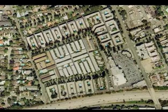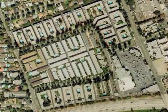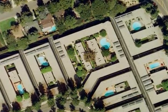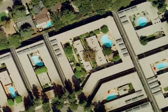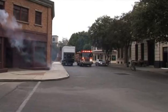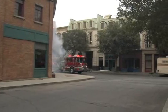One of the challenges that an engine company will face from time to time is when a fire breaks out in a large apartment complex. Access for hand lines is often too difficult or the distance is too great to simply pull a 1 3/4 line from the crossbed. The apartment lay with an appliance is an effective hose evolution that will provide an attack line on the fire floor with the ability to quickly add a backup line.